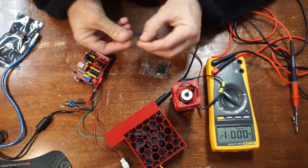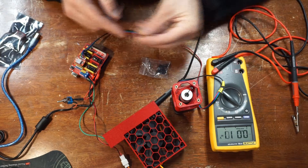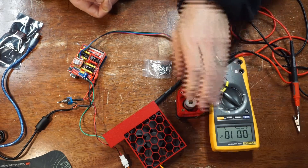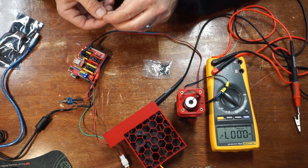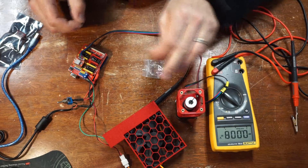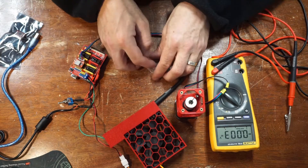I need to learn a bit more about all this anyway. I've set my Vref at 0.615. The maximum for my motor is 1.5 amps per phase. Multiply that by 8, then by the resistor on your driver — mine is a 0.1 ohm resistor. Most of the earlier ones I think were 0.068, so the maximum for me would be 1.2, which is basically cranking it all the way to max, which I'm not going to do. I'll go about halfway and that seems to work.